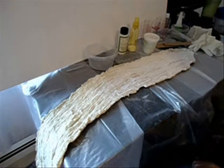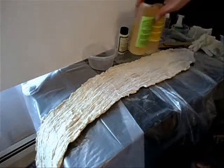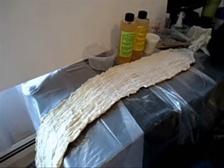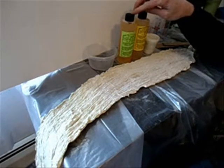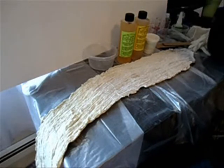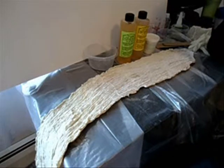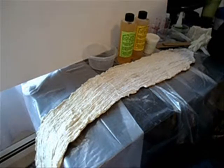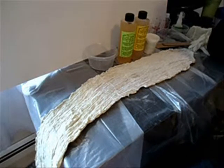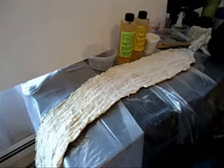I've got newspaper and plastic under some stuff. So this is going to be the first step — mixing the casting resin. You mix equal parts of both pieces and stir them together, and in a few minutes you pour it into the mold and it'll harden into a white plastic. That's the hard outer shell of the mold. Then on top of that you'll put the foam, which is kind of the backing. I'm going to give this a shot and we'll see how it turns out.